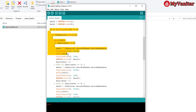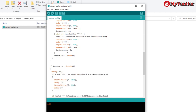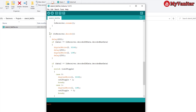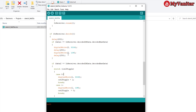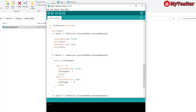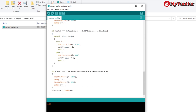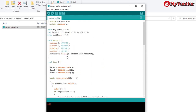In this section I record the remote buttons and IR signals, and in this section I use the recorded signals to activate the relays. This is the momentary switch, and this is the toggling switch — I've used toggling for relay number two. Momentary just sets the pin HIGH then LOW after a delay; toggling is even simpler. You have three relays — you can make all of them toggling, all momentary, or any pattern you like.